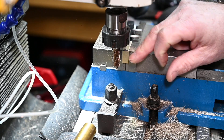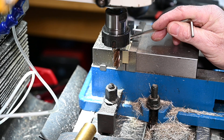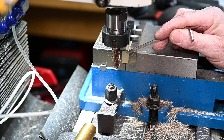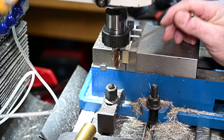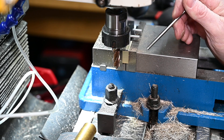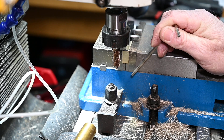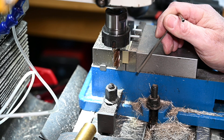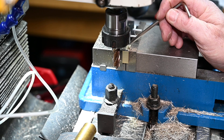The edge of the cutter was zeroed on the side of the block; I've come out 1.250, which is an inch and a quarter, and milled the ends off. So now both these pieces are dimensionally correct for that distance. I've machined two reference surfaces and I'm not going to take anything off the face that's already down to dimension — I might just polish it on a bit of wet-and-dry paper when they're finished. We can take them out now and get them marked out.